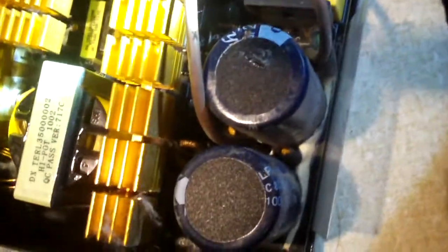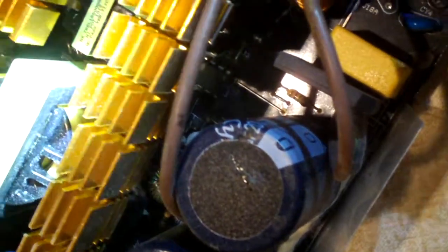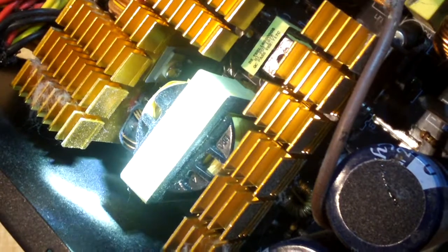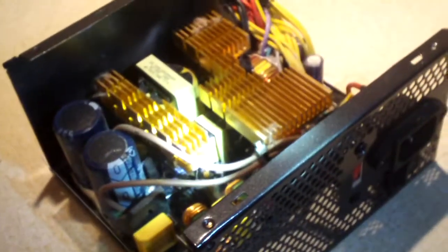Now if this thing had some slightly better quality caps, this would be a pretty decent unit for what it is. But of course it is a value unit, so I guess they didn't do too awful bad with the design. But then again, for this thing to fail and take out the breaker when it failed — that's kind of crazy. I never did ask the owner if his computer was okay, because the last time I got this power supply from him, he was still waiting on his new power supply to arrive. I need to ask him about that and see if his computer is still okay after he replaced his power supply. I'll add an annotation or update the description on this video to let you guys know. Anyways, it's been a while since I posted a power supply review to Q Computer Channel. Any questions or comments, feel free to ask, and thanks for watching.